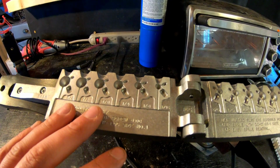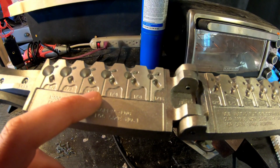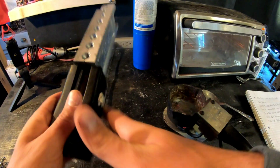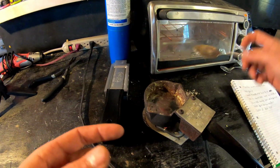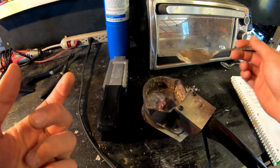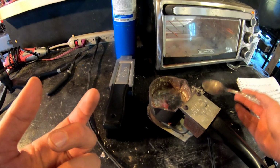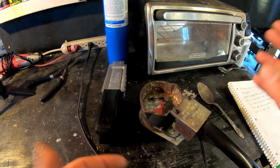This mold has 7 different head sizes: a 5/8, a 1/2 ounce, a 3/8, 1/4, 1/8, and 1/16. And then you also need a hot pot too. It's like a smelting pot that you can actually melt all your lead with. And right now I'm getting all the impurities out of the lead. This is just standard lead that I use from like saltwater weights or jig heads and stuff that's not painted. I wouldn't advise to melt the painted ones because it makes a toxic smoke.